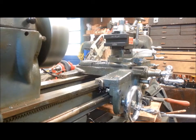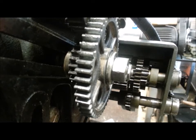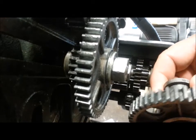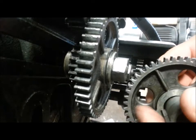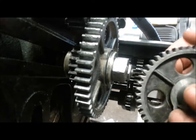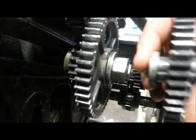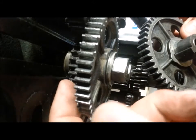There's a way, if you own an Atlas or Craftsman lathe, to reduce the carriage feed rate that's really simple. Let's go over the parts required. Originally what we had here was the slide gear — a 40-tooth gear on a change gear coupler. That coupler spins on this bearing insert, and the bolt holds it on. There's a washer over top of it. This same assembly is inside of these two gears.